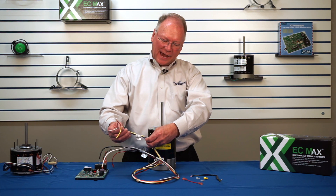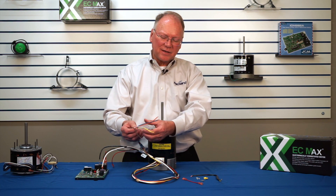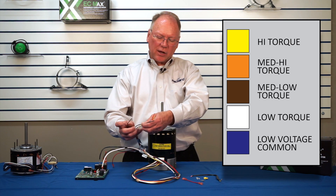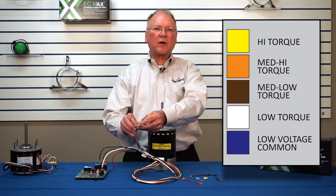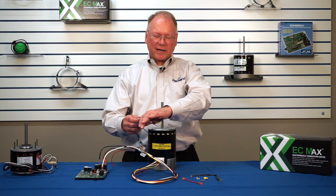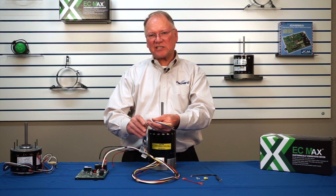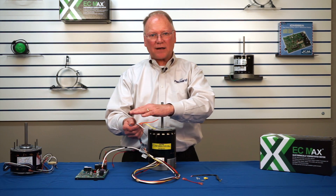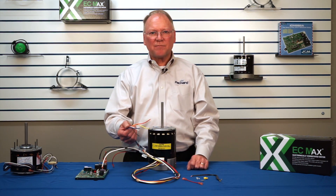The harness for the torque taps are clearly identified — these are the low-voltage taps for the motor, and the taps are color-coded. Blue is the low-voltage common, yellow is high torque, orange is medium-high torque, brown is medium-low torque, and white is low torque. These are torques, not speeds, though a lot of people think of these as speed taps. The result is a speed, but with a set load on this motor, the four different taps apply four different torques, and that load will turn at varying speeds as you use the different torque taps.